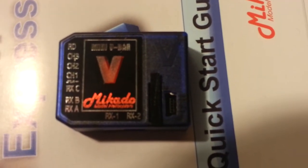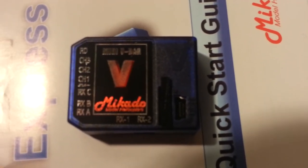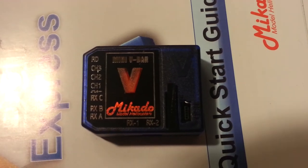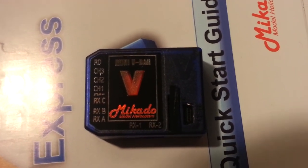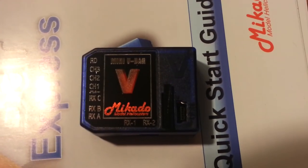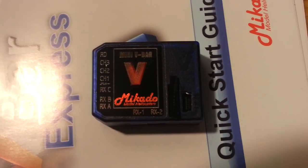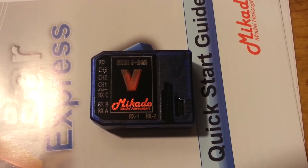The second thing: right there by the USB port where it says USB, to the right of it had the letters 'CP' on it. And the plug setup here for the four-pin plug — there was no rubber piece in there. But other than that, you could not tell. I mean, if I wouldn't have owned a V-Bar before, I never would have known — it was identical, the case, everything. It even worked on the Mikado 5.0. But the software on it was 5.0.999, which I knew right off the bat something was funny. The first thing you should do when you get these is register it — if it doesn't register, something is up.